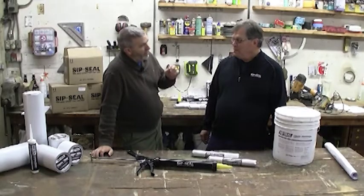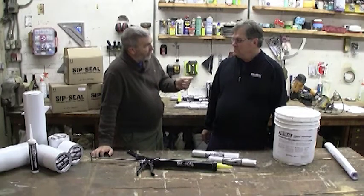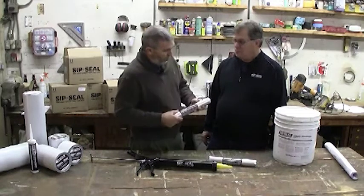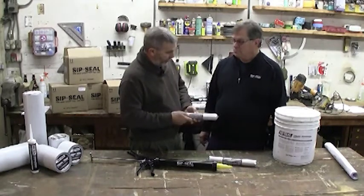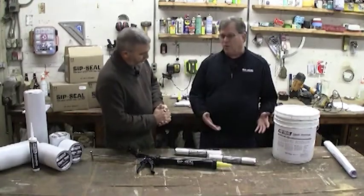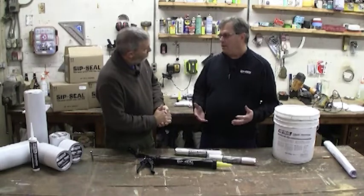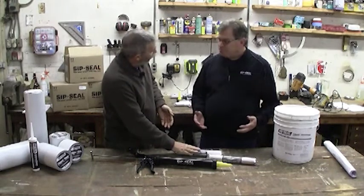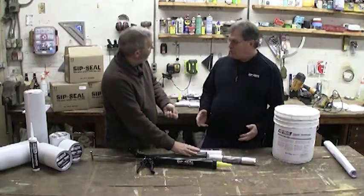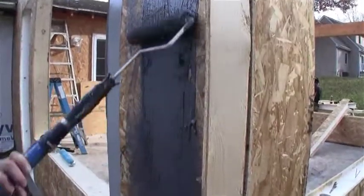That's right. So we have the liquid applied membrane, but even before we get to that, we start looking at the substrate and we're filling up the cracks and the joints with the sausage tube material that you refer to as liquid flash. Right. They're both very closely related products with different attributes for the way they are applied. Right, because obviously this one is on a caulk gun, so we're caulking and applying with a trowel. And troweling. Whereas this can be rolled or sprayed. With a spray gun.